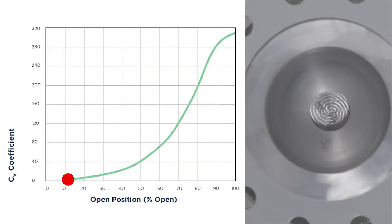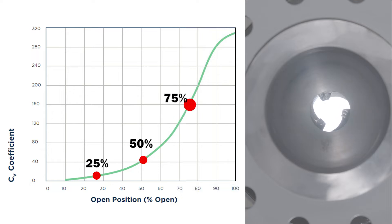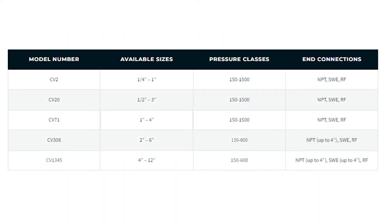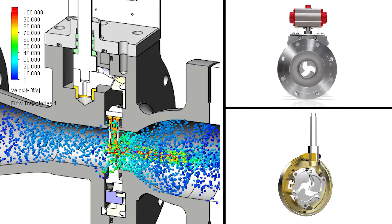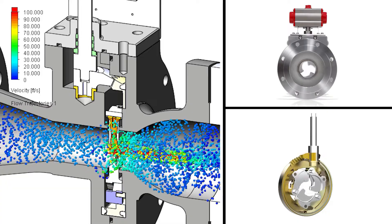Let's take a look at the valve in action with a 25% incremental step down. The Clark valve has a modified equal-percent flow characteristic curve. It can handle a wide variety of applications and media, from production applications such as natural gas lift and produced water, to various slurries, to general service control. The Clark valve comes in five different bore sizes identified by their CV and has a rangeability up to 500 to 1. The fluid is continuously in the centerline of the pipeline, improving resistance to cavitation damage and lower noise. Curved closure members allow predictable pressure drops and provide a tight shutoff.